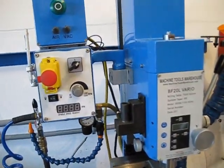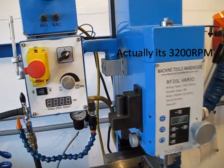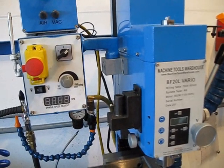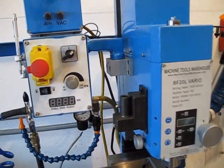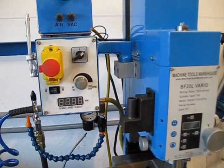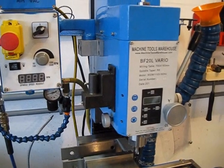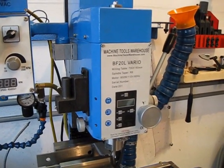I'm going to be running at the recommended 3600 RPM. I'm going to use a little bit of WD-40, and I'll do an eighth of an inch every three seconds — nice slow feed. So I'm going to be conventional milling the first pass and then I'm going to climb mill and come back. It's obviously going to be fairly slow.